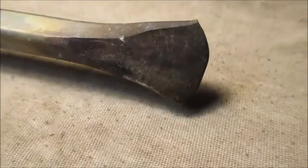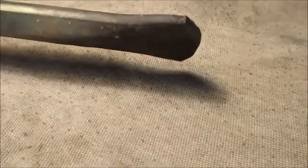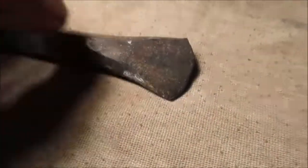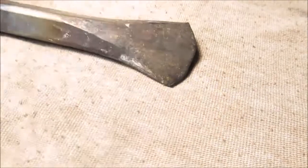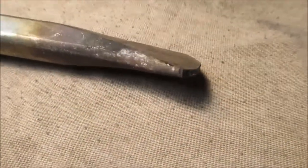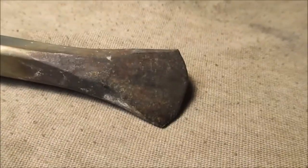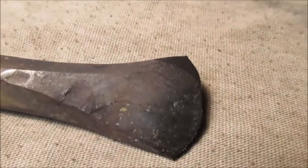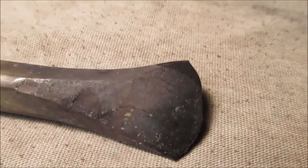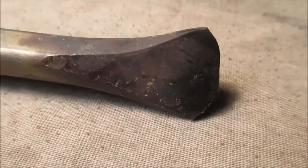Okay. I would say take a deep breath. It's not perfect. I mean, I took my small ball peen hammer out here about this far and hammered a little more to get it. We're going to wire brush it off. We're going to do a lot of file work. We'll round these corners over. We kind of put the Sharpie marker on it, but that's really not the way we want it. See that? Kind of around the corners. Because it's going to be a tire tool.